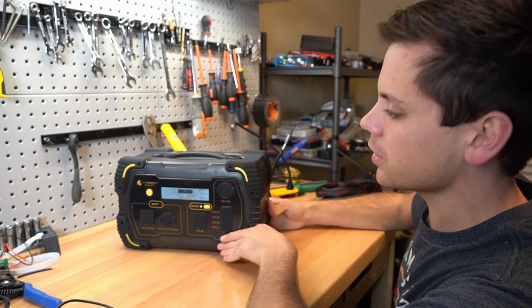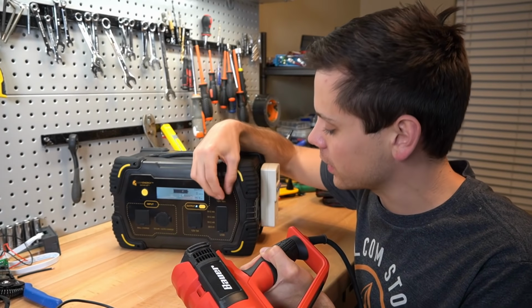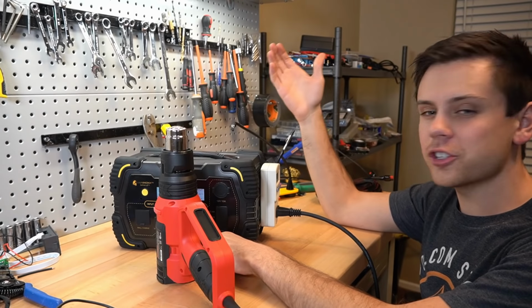All right, so the inverter's on. Let's get out our watt meter. Honestly, if these are not regulated, I would just say that they're unusable. You can find your own way to regulate it, but it's just not useful if you do not have 12 volts at the 12-volt receptacle. We have 137 watts.